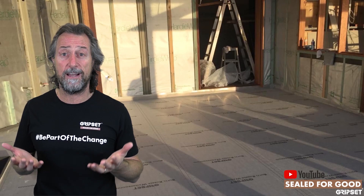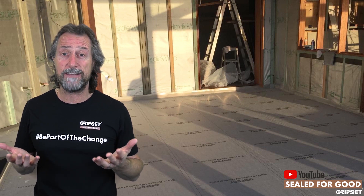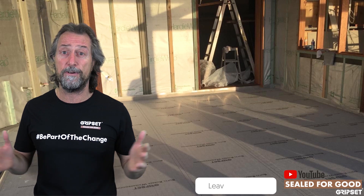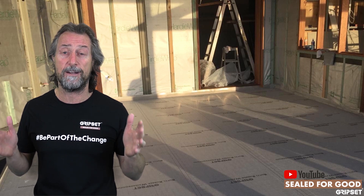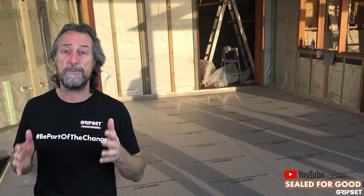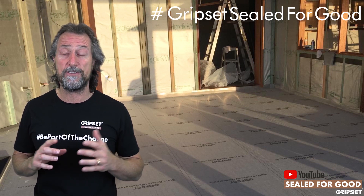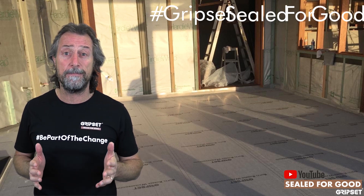There was one job I recall many years ago — it was a prominent client — and I got asked to go out there and inspect it. I said, guys, you need to pull this floor up, rebate that timber, and get it right. Because the waterproofer had waterproofed the job, there was ponding water on the balcony before they'd screeded it, so it showed and proved that the waterproofing was done correctly. But there was no way, once the tile was installed, that it was going to have anywhere near the finished floor level heights required. We've got situations on beachfront homes where water and access of rain in behind the membrane can be a real problem — and is a real problem.